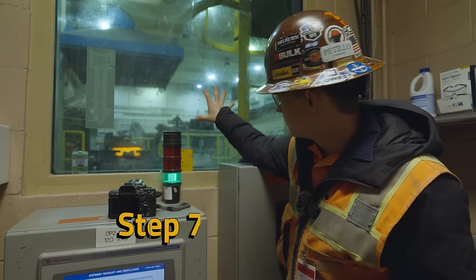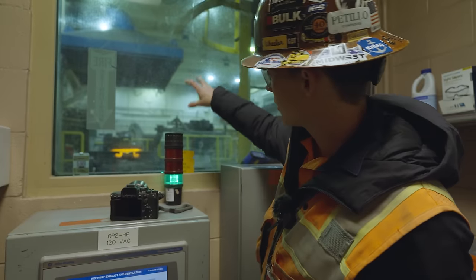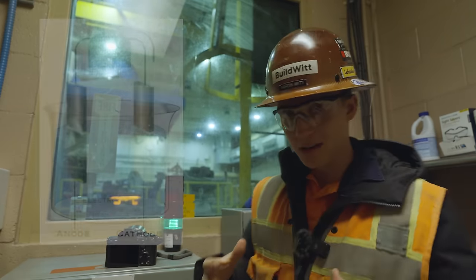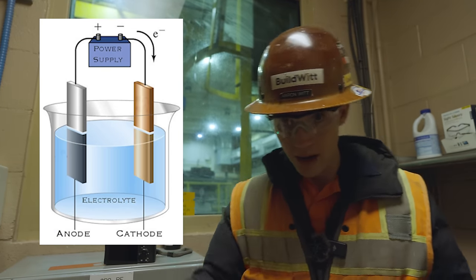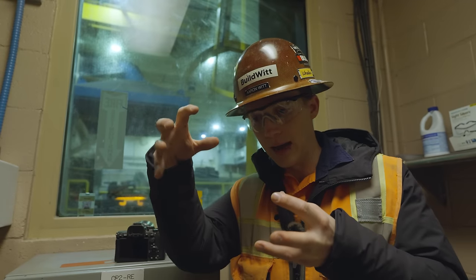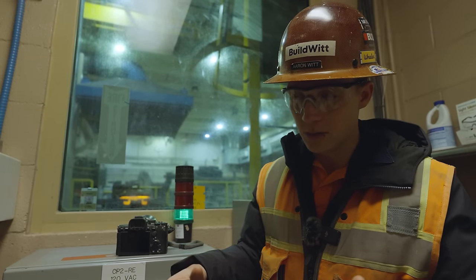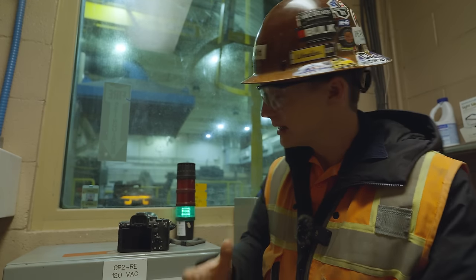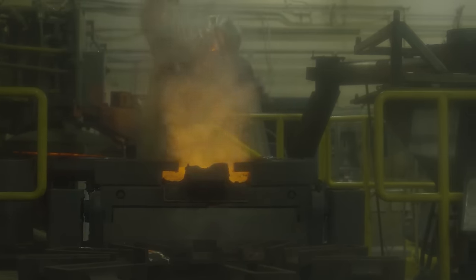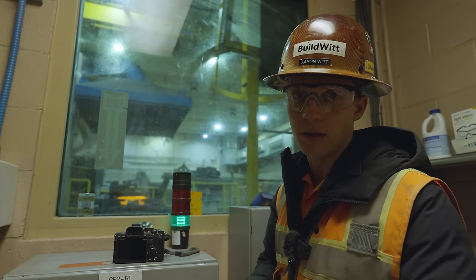This is the final step of the gold mining process: the refinery. That vial of yellow liquid comes over here to two tanks. We can't go in because of fumes and PPE requirements, but those tanks have anodes and cathodes. They run a current through the liquid and that electricity excites the gold, bringing it out of solution into steel wool inside the tanks. They wash the gold out of the steel wool, creating a wet sludge, then dry it and put it into that furnace, which turns it into liquid — mostly gold but also some silver and other metals — and then pour it into those bars, let them cool, and load them onto an armored truck.